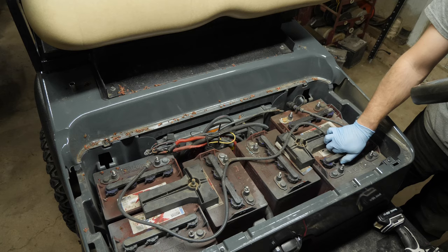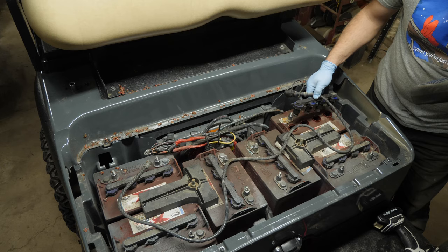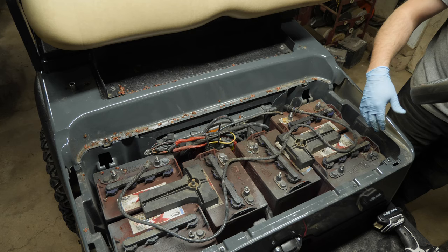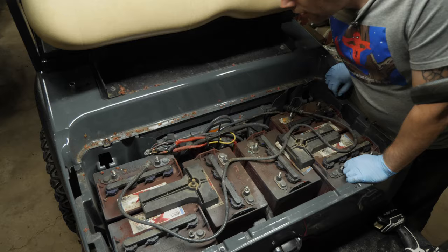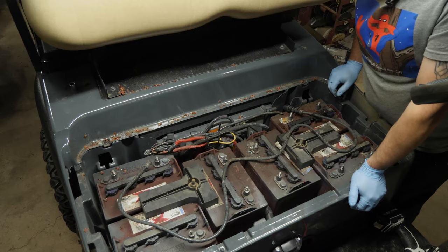Whatever is getting fed through this autofill hose, I don't know if it's distilled water or tap water. Some people say you can use tap water — go ahead — but if I sell you batteries and you use tap water and the battery fails in two or three years and they find minerals in there, guess who's eating that cost? You, not me. These batteries all stink. They're actually bulging on their sides. When the battery case bulges like that, it usually means they're near the end of life — the plates or insulators between the plates are swelling.